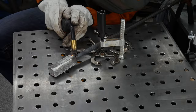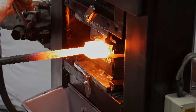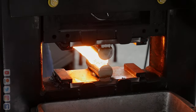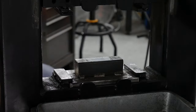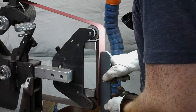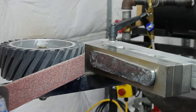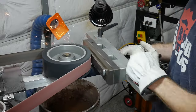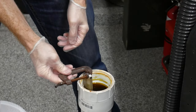With the canister removed I welded on a handle and got it back into the forge to be drawn out into a billet. I stopped processing this billet around three-eighths of an inch thick in order to clean it up and see what I was dealing with before forging it into a blade. I ground out all the scale and pits on the 2x72 and then surface ground it to 320 grit on my DIY surface grinding attachment. I etched the billet in a 50-50 ferric chloride and water solution for 20 minutes and then cleaned it up with some steel wool to reveal our pattern.